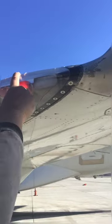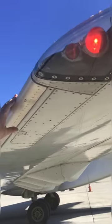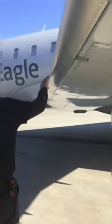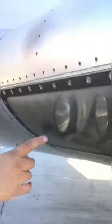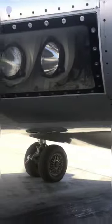Take a look at the trailing edge of the winglet — no damage. Primary nav light is on. You might get a little bit of bubbling on the wingtips — you can disregard that so long as you don't have any cracks and all your screws are secure. Clean — no bugs, no bird strikes. All the panels — no leaks and everything's secure. This flat cutout, just like the other side, make sure you have no birds in there — any kind of foreign object damage that could have gotten stuck during takeoff, flight, or landing. On your landing lights, check that they're not cracked and the lens itself is not cracked. All the panels are secure.